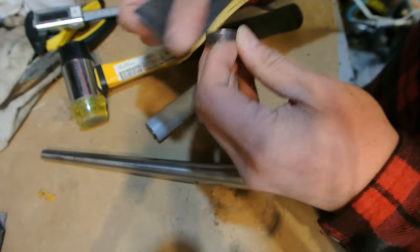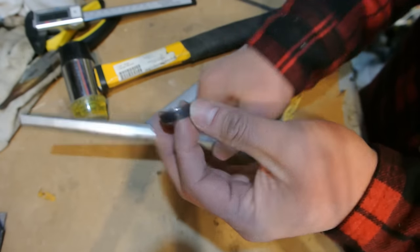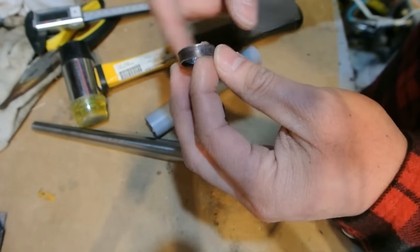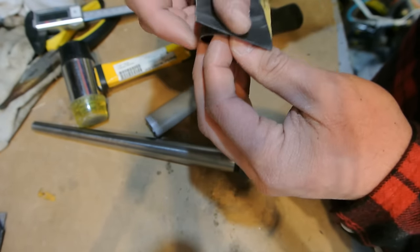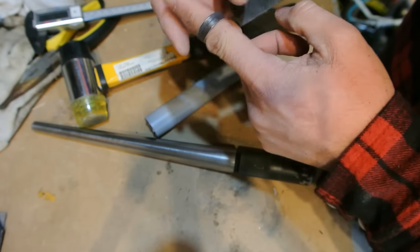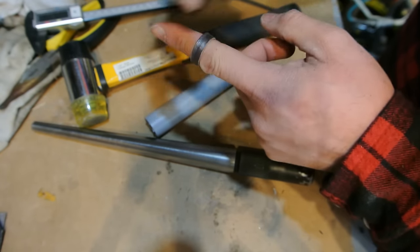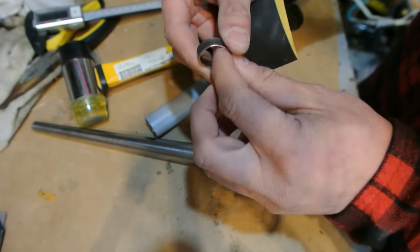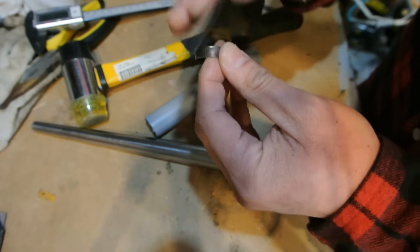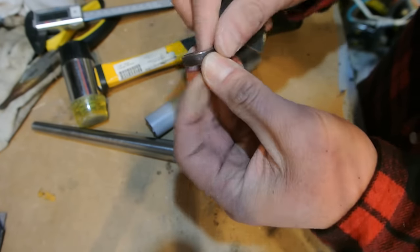If you're not concerned about the lettering, you could just use a regular hammer and beat at this on the ring mandrel and just get a smooth ring. And then you could grind it out with sandpaper, or polish it away. You could stick it on a drill, like on a spline on a drill with a piece of pipe, and then spin it to even it out. That's another option. I did that in the silver spoon video that you could check out on my channel as well. So I'm just going to even out all the edges here so there's nothing sharp.